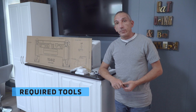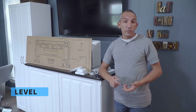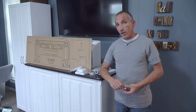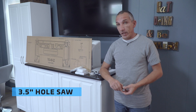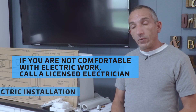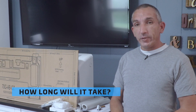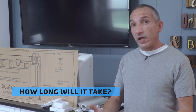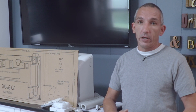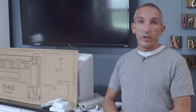Other tools and things you'll need to complete the installation: a Phillips and flathead screwdriver, a level, a power drill with a Phillips bit, wire strippers, needlenose pliers, and a three-and-a-half inch hole saw. I already had the electrical pre-ran by a licensed electrician, so that portion is complete. As far as the EZ-Connect system itself, depending on your skill level, it can take anywhere from two to probably five hours. Having another set of hands is always recommended — it'll make the job go a lot easier. If you're doing this on your own, put away about half a day.